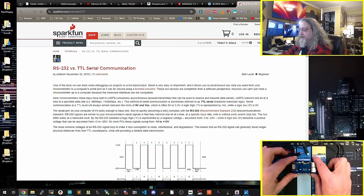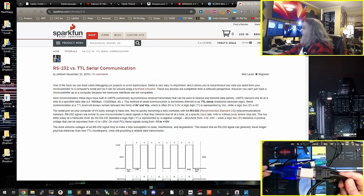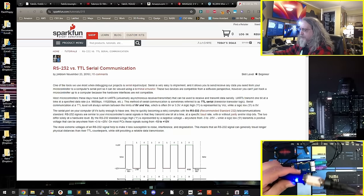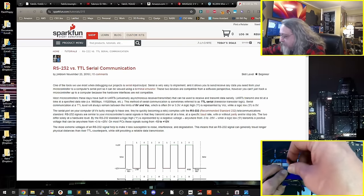So set this aside. So here's the board plugged in, same code, same flash, same everything. The only difference is it's running the DB9 serial out. So what I'm going to do for this demo is we're going to show how you can get a serial port or console on a Raspberry Pi. In theory, it could be anywhere else. So to get real RS-232, I have this USB cable coming out of a Raspberry Pi with a gender changer on it. So this is on the Raspberry Pi as USB 1 for a device, I think. And then I just have a cable coming down here, coming in, and let's see. Connect power.